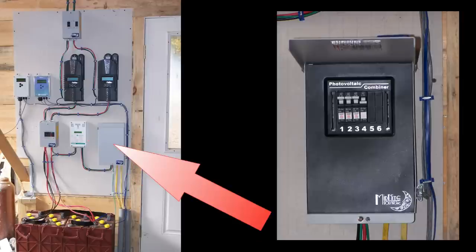Last, a single line goes from the batteries through a 40-amp disconnect breaker and through a Xantrex C35 load controller. Then the line goes into a circuit breaker panel, which is used to distribute power to the various devices.